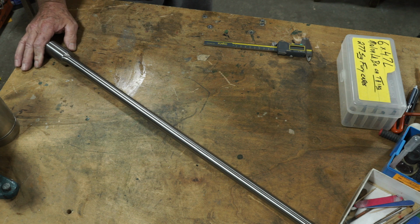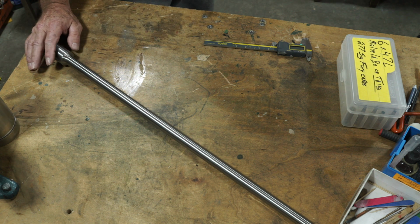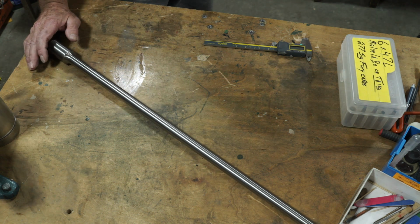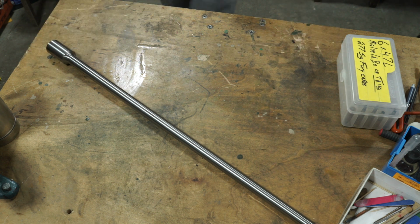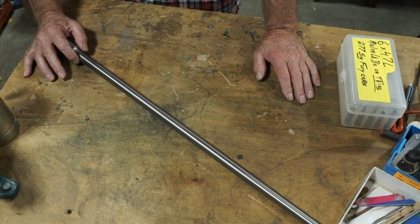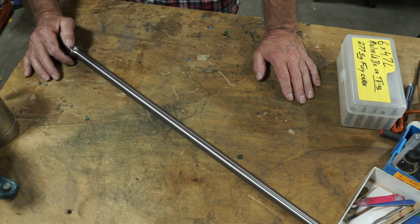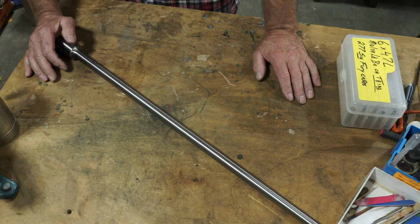for whatever reason, whether it's the junk or the sloppy case head or the huge 80 thousandths diameter flash hole, doesn't matter to me. I might take it up later sometime. I'll learn something. I'll get another lease on life. Maybe I'll go back and fire these cases again. They're not going anywhere. But for right now, I'm going to go in and design a reamer tonight for the 277 SIG Fury. And then call around to all the makers I know and say, hey, you got anything out there on the ground? And waiting for the new case to come out?